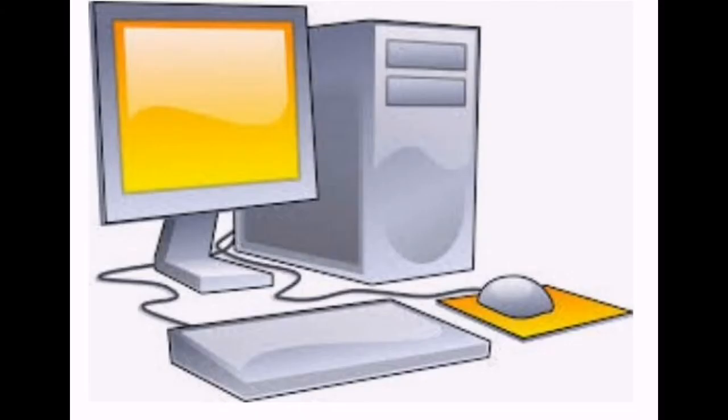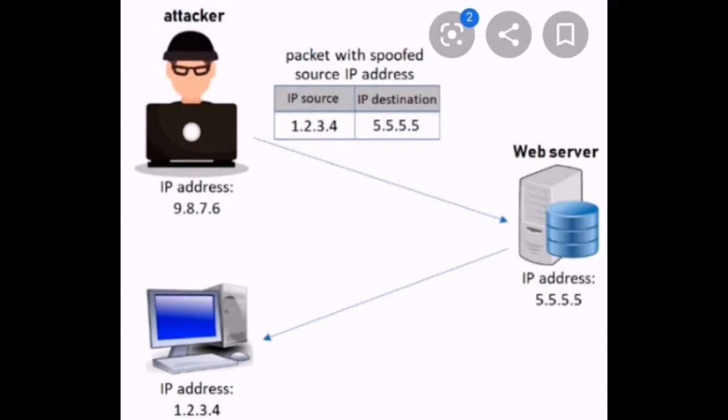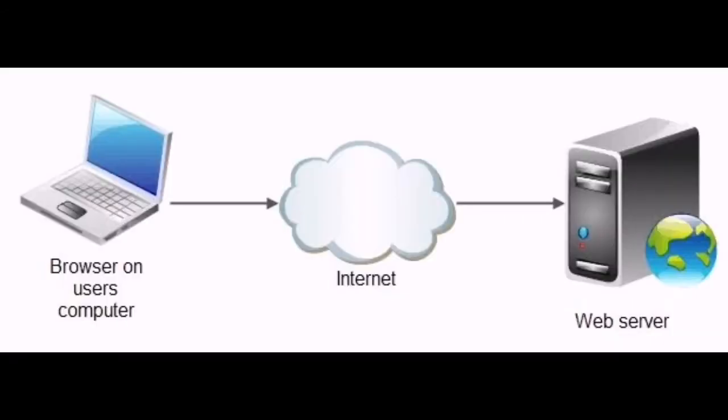Each PC which has an internet connection is identified by a unique address called an IP address. The communication within the network is established with the help of the IP address. The Ethernet controller receives the request from the user PC. The Ethernet controller checks whether the incoming information corresponds to it or not. If the information corresponds to it, the information is conveyed from the Ethernet controller to the embedded microcontroller. Otherwise, it is ignored. So the user can see the web page in the PC.